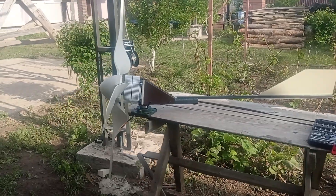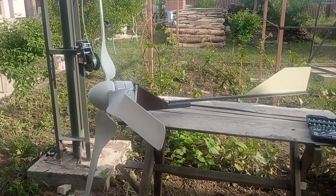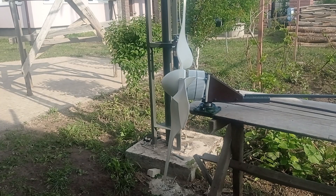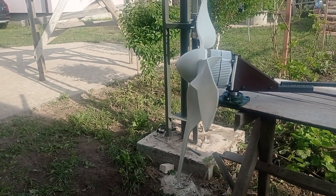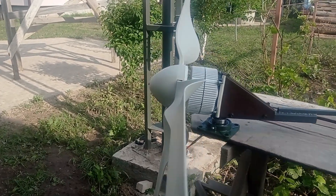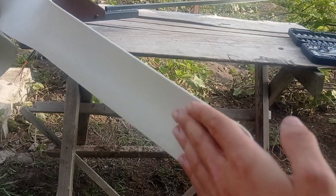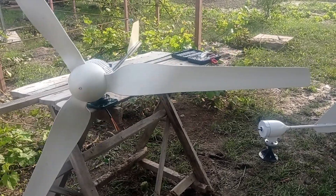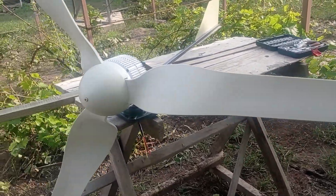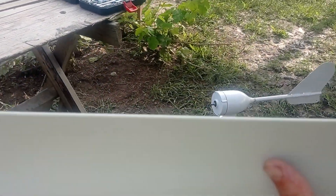Now take a look at what the tail size should look like for this wind turbine. The wind wheel is 1.65 meters in diameter. You can see how nicely the blade is bent — exactly like the book says. It has a very nice startup zone and is very thick — you can see relative to my hand — so this blade will capture a lot of wind and work really well. It's much better than what they supply on the smaller S-series. It's plastic, probably nylon, but it looks really sturdy.